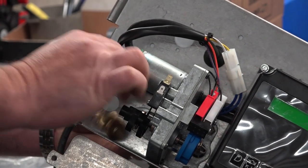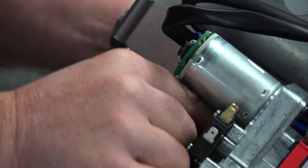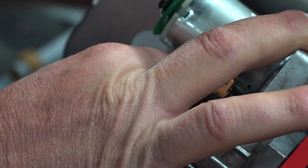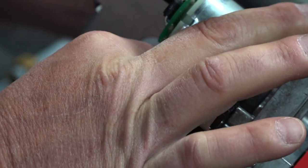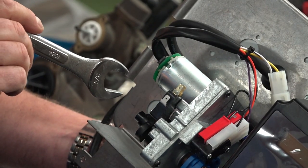And then you can go ahead and insert the... And actually, when you insert the brine valve, one thing, you got to make sure you insert it through the nut, otherwise you're gonna have to redo it. Put the nut on first. Put the nut through there first and then line the brine valve up. And that goes straight up? Points to the side. Should be this, which is where that line hooks up. Where your brine tank, brine line hooks up. At this point, it should be right on there. Yeah, that looks good to me.